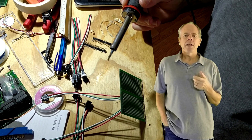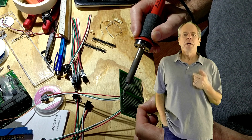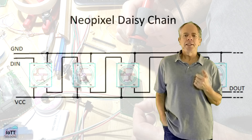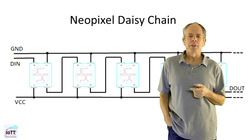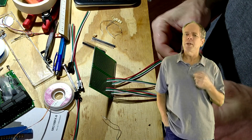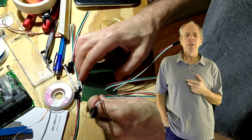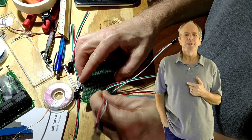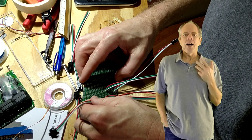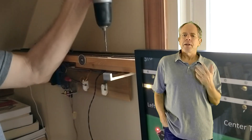For the electrical connection, I soldered a male and a female end of a standard LED cable to a prototyping board and added some pin headers to it, so that I can daisy-chain the boards using standard 3-wire cables. On my test layout, I have always three signals relatively close together, so I can wire three signals to the same board. 5V and ground can share the same pins, and for the data wire, I just need to make sure that I connect the data out wire of one signal to the data in wire of the next signal. Really simple.